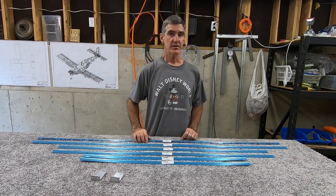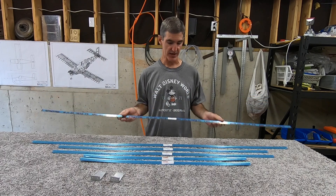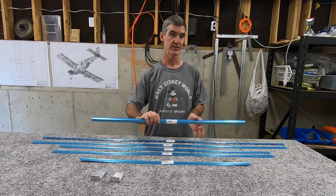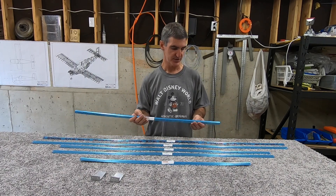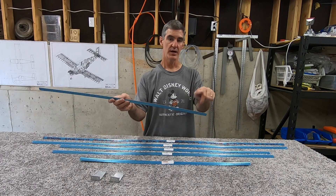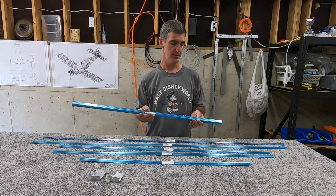More cutting and filing today. I'm going to move on to page 8-4 and work on the horizontal stabilizer front spar caps - these two long ones. I'm also going to work on the two long stringers as well as the two short stringers. It's a similar procedure to the vertical stabilizer spar caps where you use these notches that are already on the part: draw a line, cut that away, file it smooth, deburr it, clean it up nice.